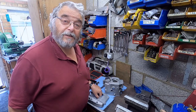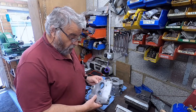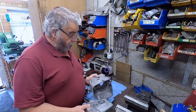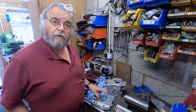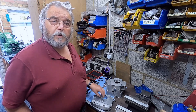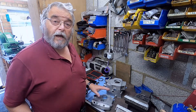The gearbox I'm going to build will be on the bench, and then once I'm happy with it I'll take this whole thing apart and install it. I forgot to turn the camera on, so you didn't actually see me doing a survey of all the various bearings. I've cleaned all these up and they've come up very nicely. I've measured up all of the holes in the gearbox casings where I need to insert bearings or bushes, and all of them are slightly undersized compared to the item that has to be inserted. So there's going to be an interference fit everywhere — I'm very happy about that.